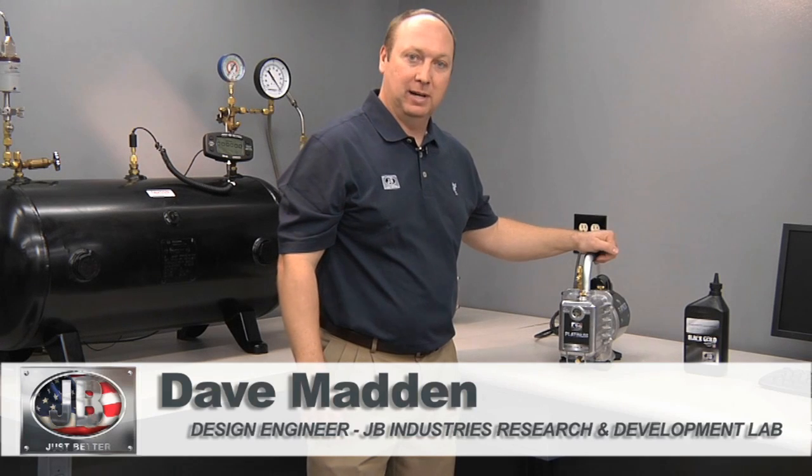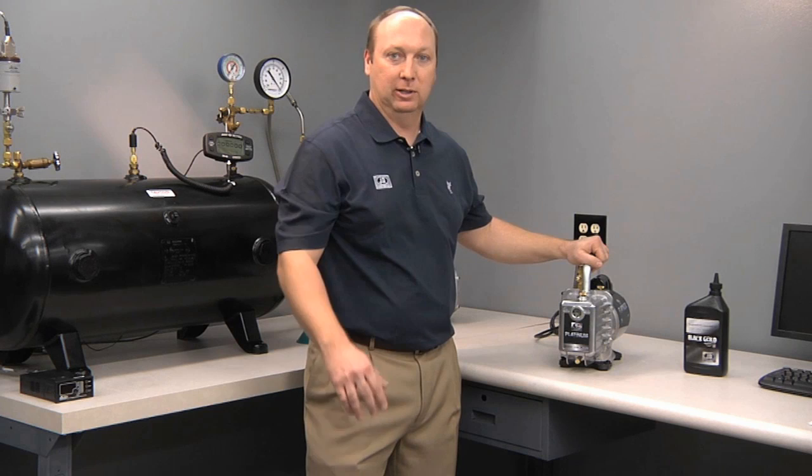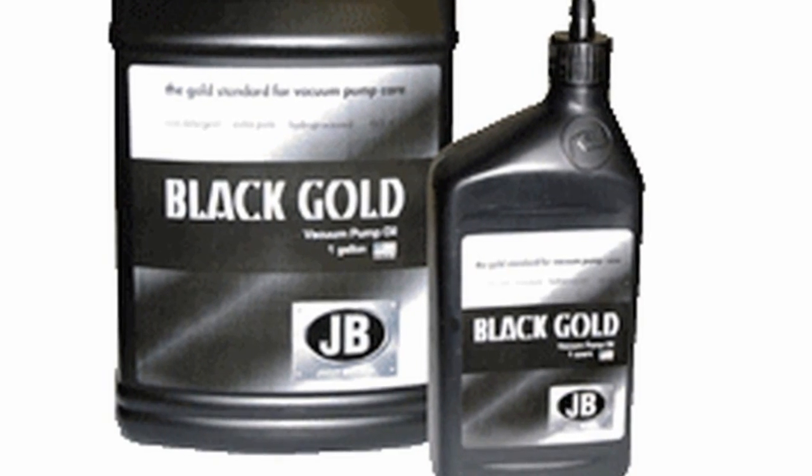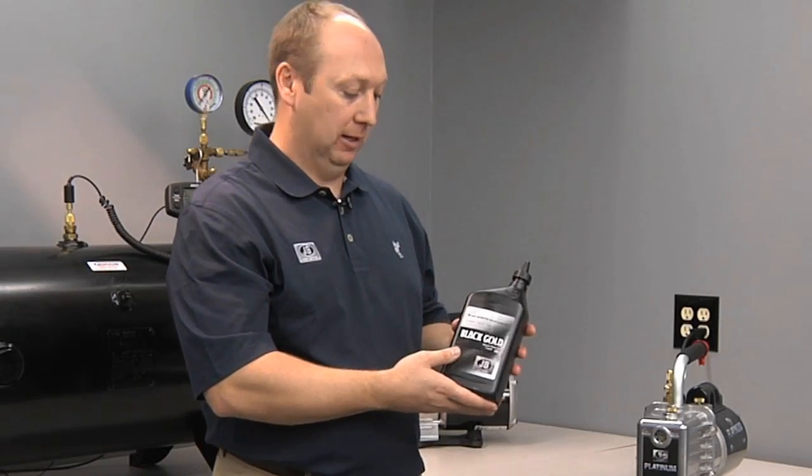Today we're here to talk about the JB Platinum series of vacuum pumps. The first thing you do when you buy your new JB vacuum pump is fill it with oil. Running the pump without oil can cause severe damage. So in the box with your Platinum pump, there will be a quart of Black Gold JB vacuum pump oil.